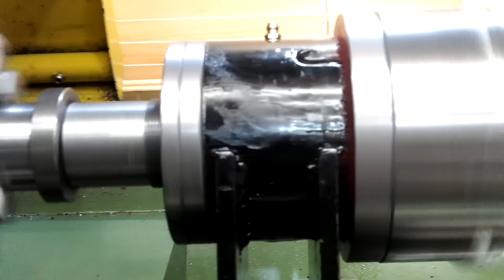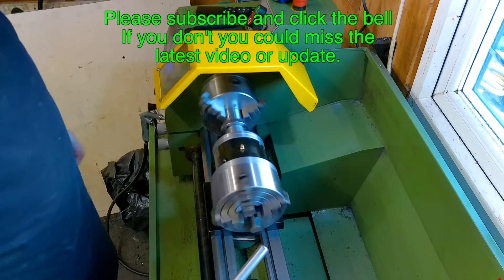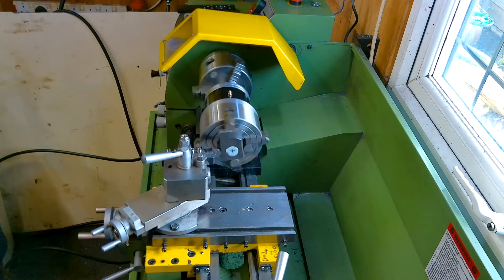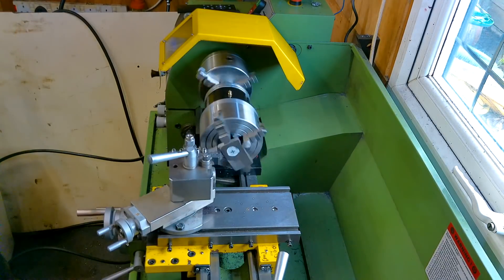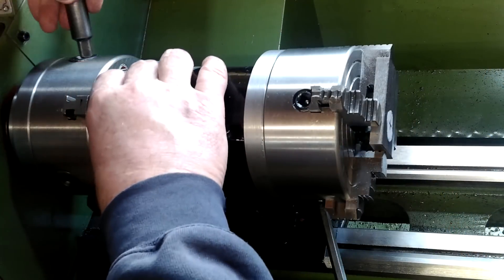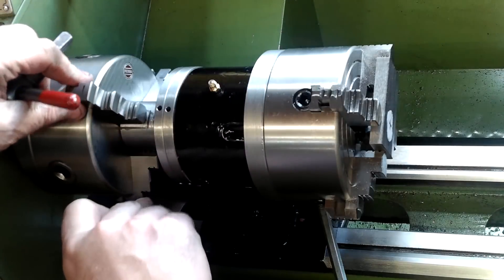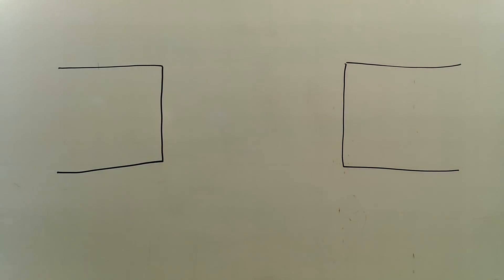Although I spent a lot of time trying to ensure the utmost precision during the construction of the two-chuck system, there are many times when things may not quite go according to plan, causing the four-jaw chuck's spindle to become misaligned. Any misalignment between the three-jaw chuck and a restrained spindle directly attached to it will inevitably damage something, so I need what I'm calling a flexible kinetic parallel coupling. Flexible so that it allows connection between the two misaligned spindles. Kinetic to remain connected but rotationally inflexible, so we're not using rubber between the two components.